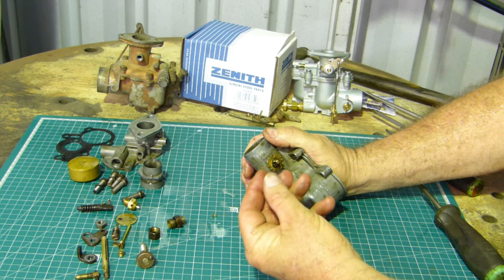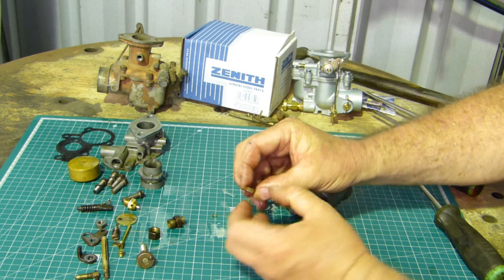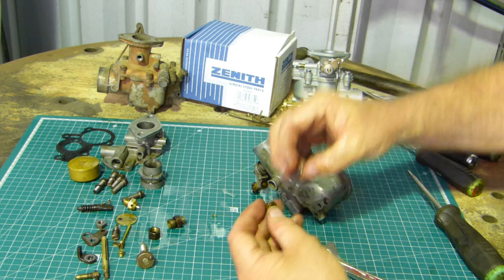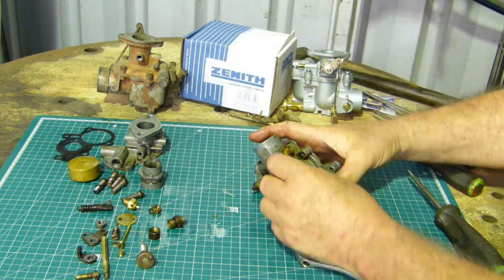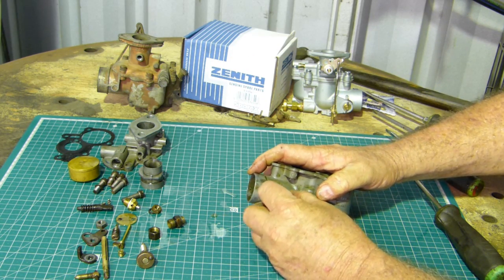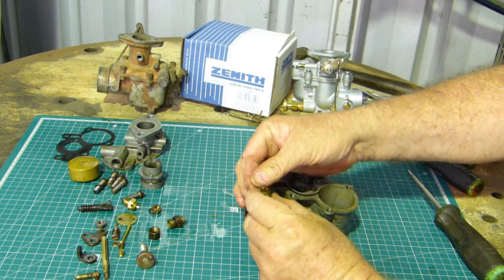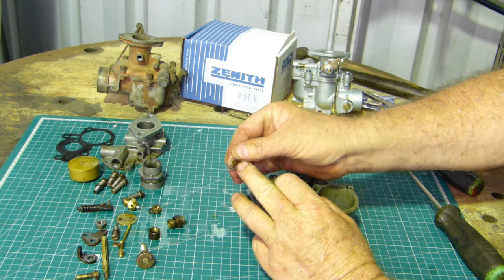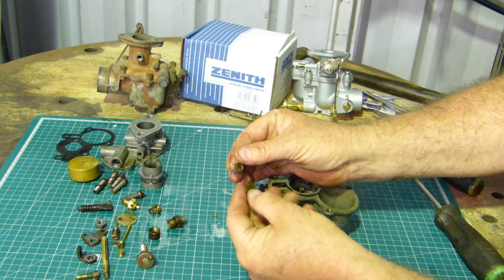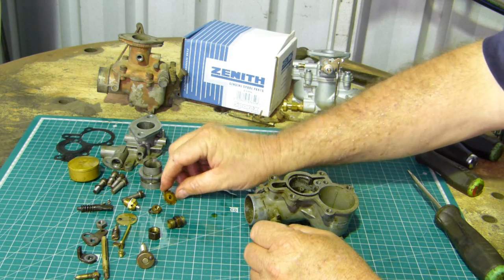So we'll undo the nut. That's been undone before. You'll notice that there's a flat side of a nut, then a curved side. The curved side always goes out, away from the washer. So that nut's on back to front. Now this little fella here, he has a bush inside him that centralises the spring on the shaft. We'll pop him back there.